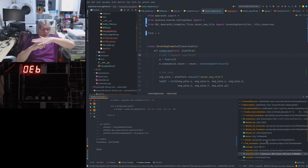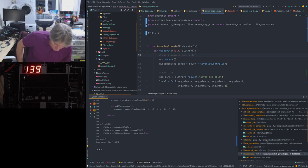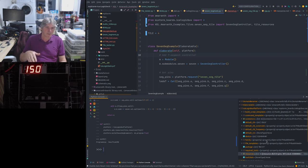Now, those female connectors sit on the bottom, one for each tile, because there's four tiles. When I reflowed them, they actually fell off. Even though the paste holds them on when it's cold, when it heated up, it became so liquid there wasn't enough surface tension to hold the weight of the connectors. So even though the top was reflowed perfectly, the underside was a pig's dinner. It was a right mess. All of the connectors fell off apart from one, which was still connected on one side, hanging on by a thread, which made it really awkward to sort out.